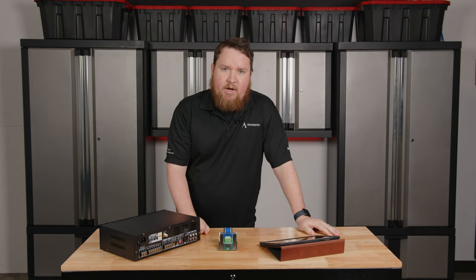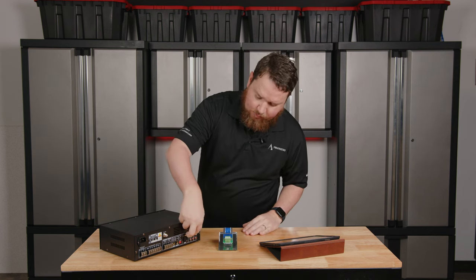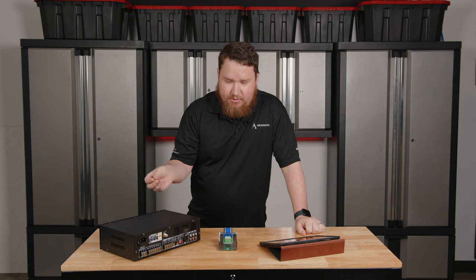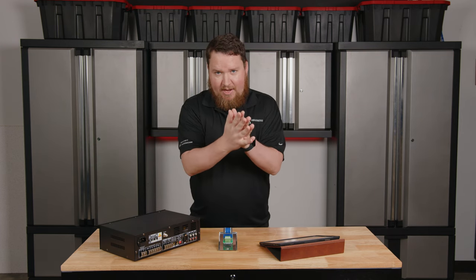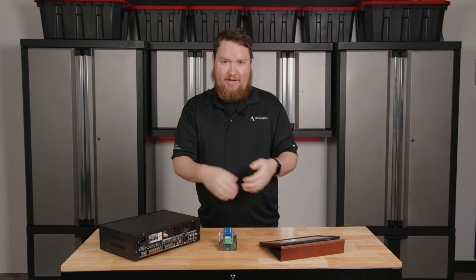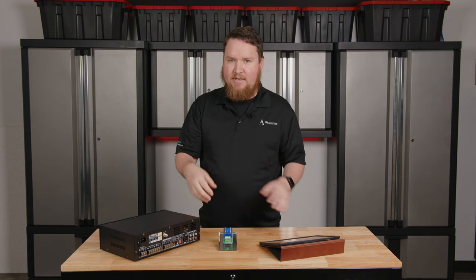That's why we sum all of the information to mono inside of a 70 volt system, and that's actually done internally inside of the amplifier. On one of our MA series mixer amps from Pure Resonance Audio, you'll see stereo sources — red and white RCA inputs — but you're only going to have one output coming out of it. That's because it sums the information inside of the mixer amp and outputs from a single output. That's not the same as just taking your left channel and right channel and smacking them on top of each other — there are transformers and balancing done internally to make it sound as good as it's supposed to.